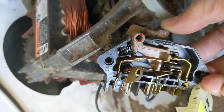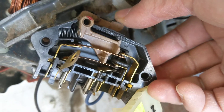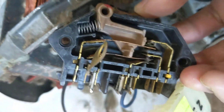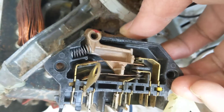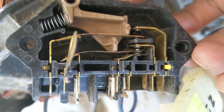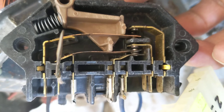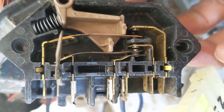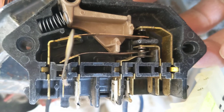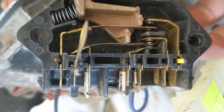This is the switch — the motor switch, the centrifugal switch. When it's not running, this is the position. When the motor is not running, the hot is connected to the white with the red stripe wire, which, until you press the button, is not connected to anything.